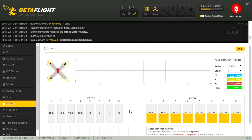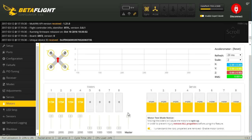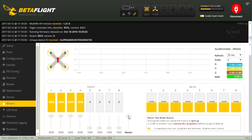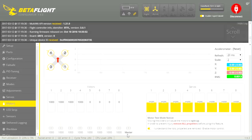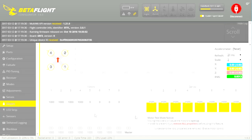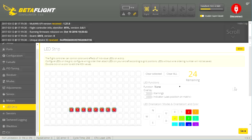In the motors tab, we should calibrate our ESCs. You do that by checking the box, putting your master slider all the way up, plugging in your battery, and listening for the tones. The ESCs will make their tones — it'll be kind of long, and when it pauses or finishes, you lower it all the way to the bottom, it makes another series of tones, and you're done. I always suggest you do that — we can't rely on the factory doing that for us.